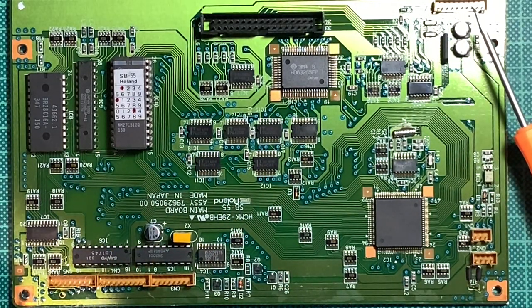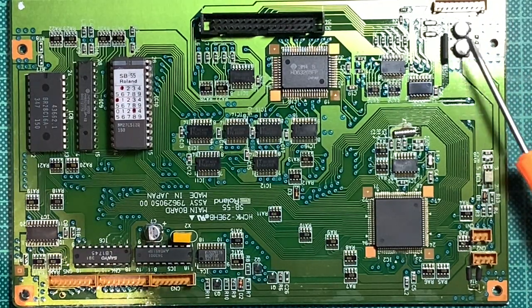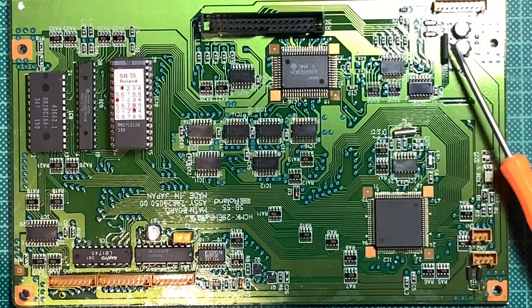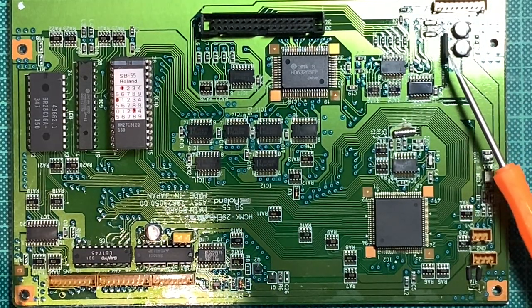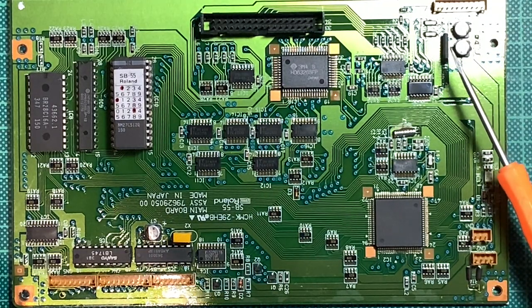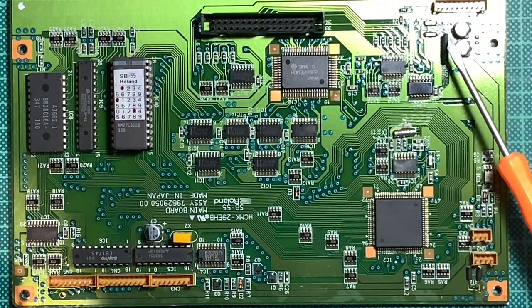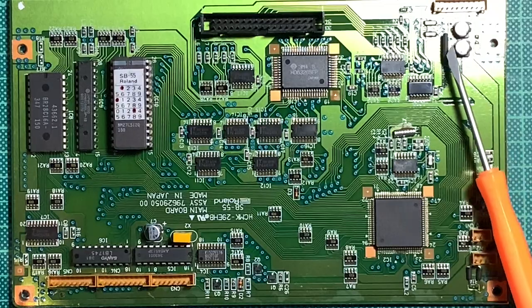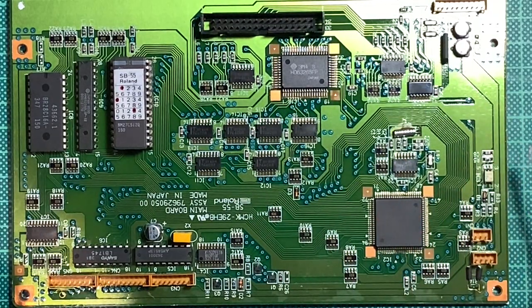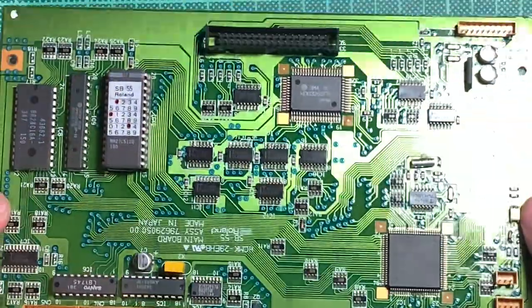And this is the connector to the back of the board, so this is probably a power supply plus the MIDI signals, which don't need that many wires, I guess. And there's one more thing here, a little zip package. It's also an IC, a current sensing IC, which probably also protects against polarity mistakes, I hope. But that's for the power supply, I would guess. And this probably just detects if there's the 9 volt with the right polarity and then powers on the rest of the system without everything getting fried. Yeah, so it's definitely typically high Roland quality, I say.